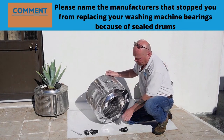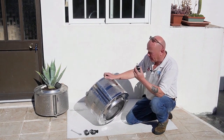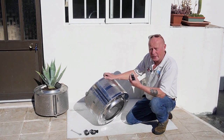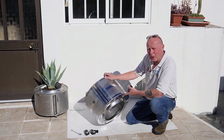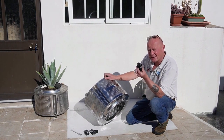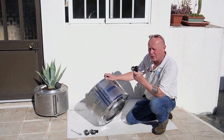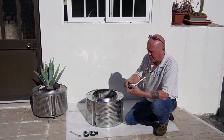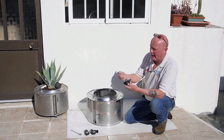The first thing we need to do is put a set of wheels on. You really want to get the heavy duty ones because we're going to be filling this full of concrete to support the clothesline holder. It's going to weigh about 200 kilos altogether, so you really want the high-rated wheels they use on toolboxes. You can normally buy these on eBay for under £10 for a set — you get the wheel with the shaft included.